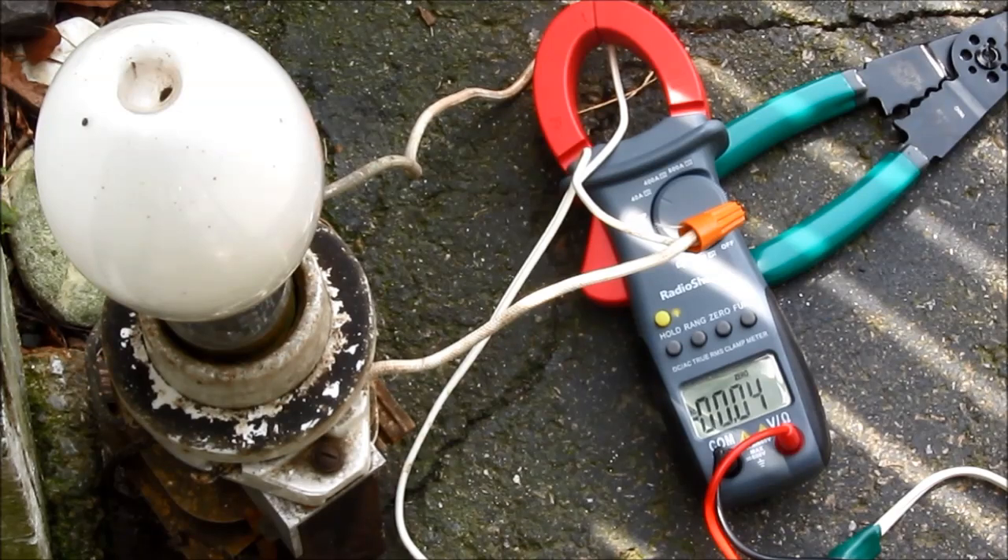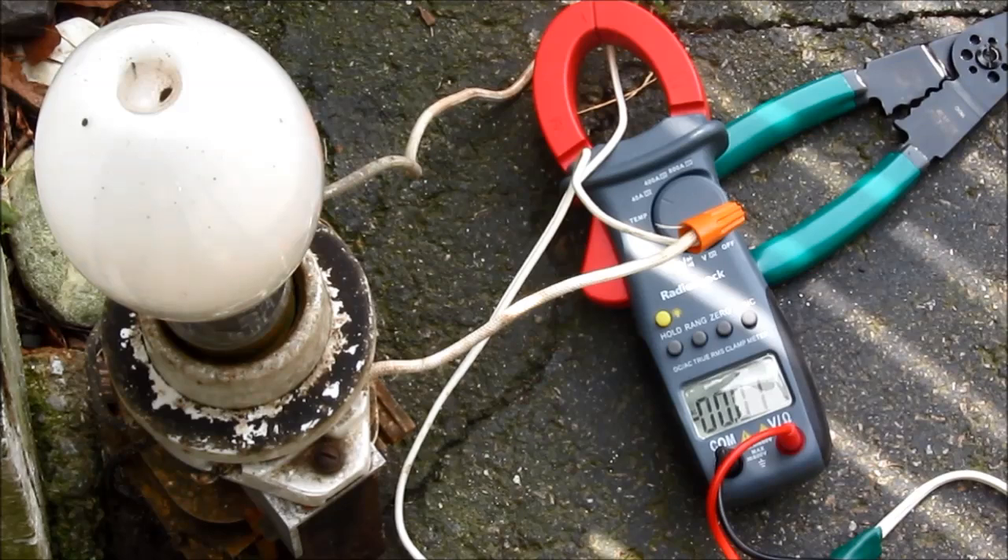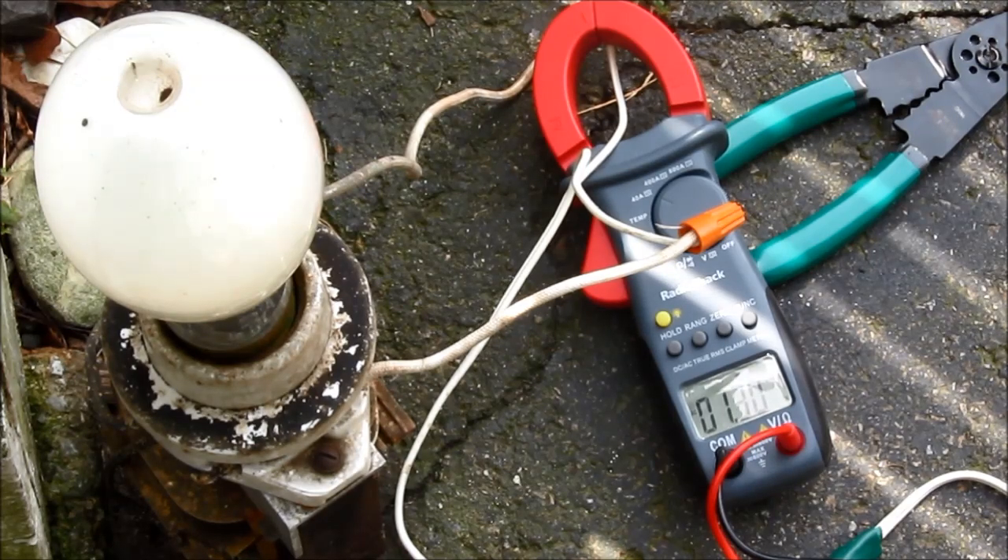The ballast that does not use a capacitor is up for testing first, since it's in a bit better shape. I've made sure it's not gone to ground in any place, and I've put my clamp meter on to get an idea of how much current it pulls. I'll be using the Variac to turn it up slowly, just in case something funny happens, and hopefully we get this thing to light. The lamp appears to be flickering a bit and trying to start. The input is at a tad over 120 volts AC, pulling 1.3 amps as the meter shows, and the lamp has fired up.